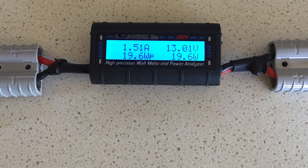The next cumulative measure is WH — watt-hours. This is another measure of power, and again it's cumulative, increasing over time to give you a measure of how many watt-hours were consumed by the load. After watt-hours comes AP — amps peak. This represents the maximum amount of current that has been in the circuit since it was turned on. For example, if you had a solar cell in ideal conditions really producing a lot of current, it will show you what the peak value was.